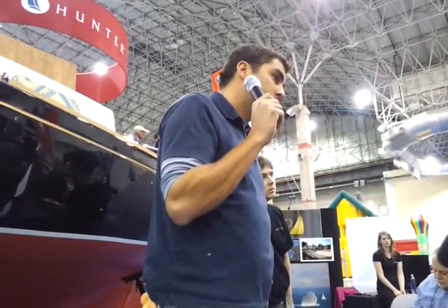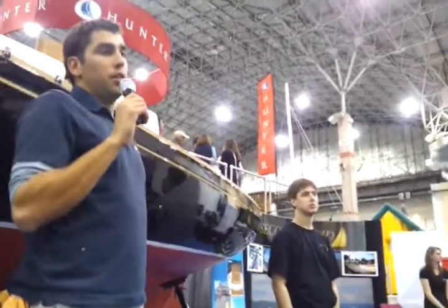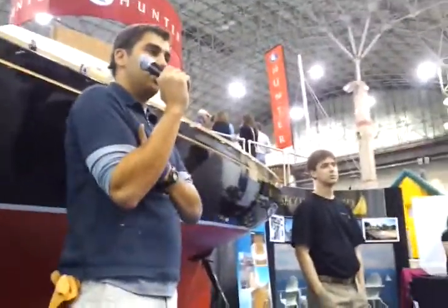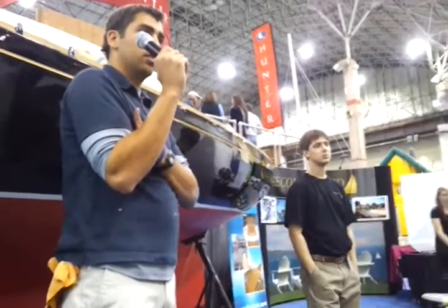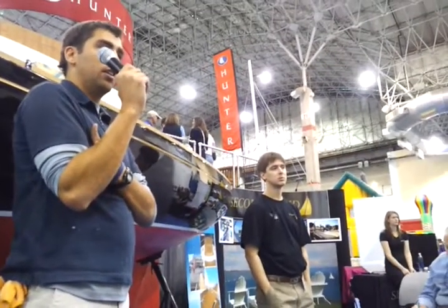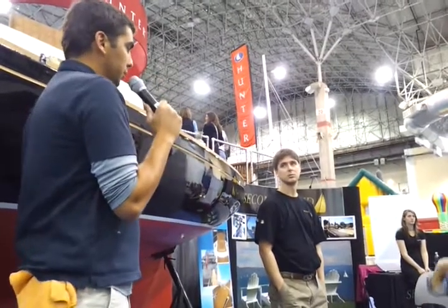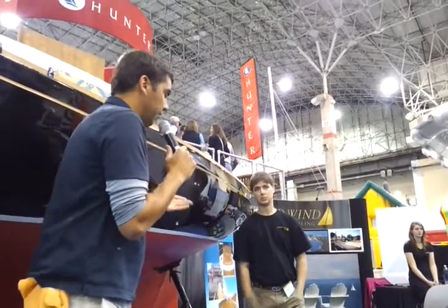What do you feel about using gel coat sealer on the deck? Can you name the product name, the brand name? I don't know. What's the alternative? I have a lot of particulate on the gel coat. Like overspray particulate? Well, overspray you can remove with a clay bar, or you can buff it out.